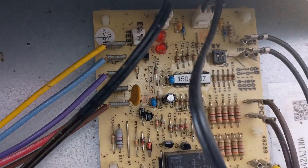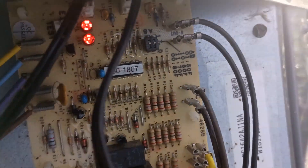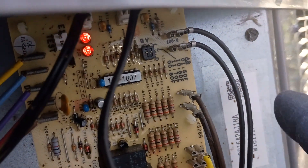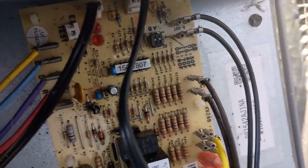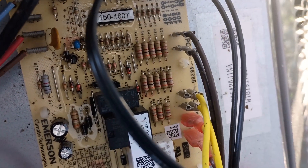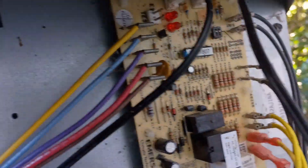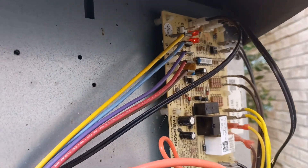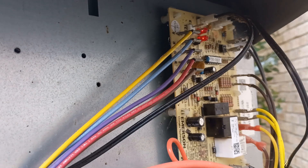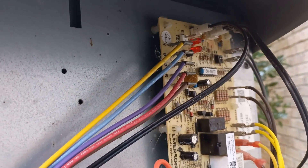That's going to give you your choice of temperatures. You can see all the temperatures there with the arrow pointing, and it tells you how to do your dip switches so you can change your termination temperature. These things come factory set at 70, so that's good - that's where we want it. Lennox puts them at 50 and it just doesn't thaw that coil out good enough. Rheem's doing it right at 70 degrees; you should never have to change that.